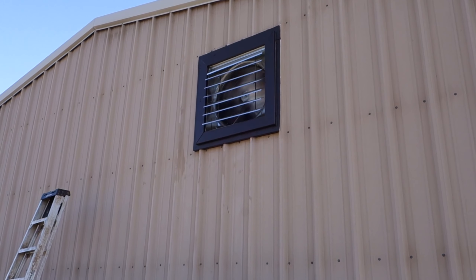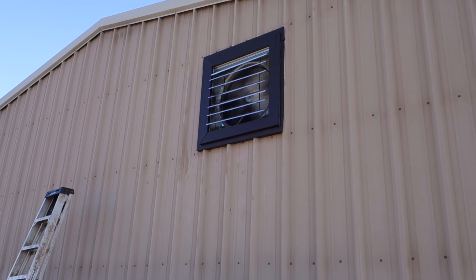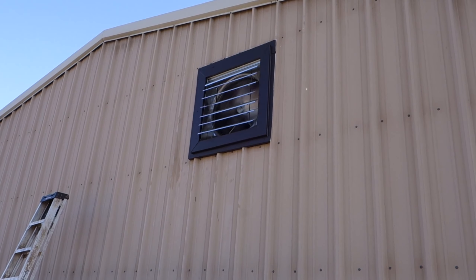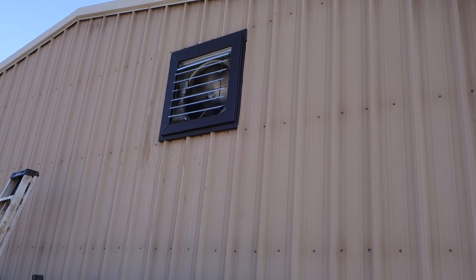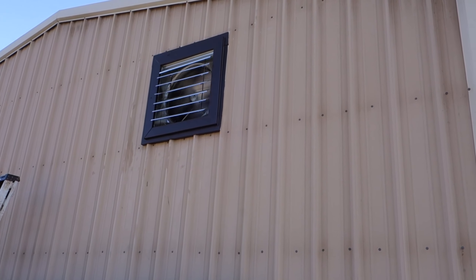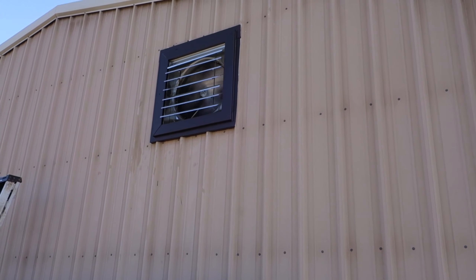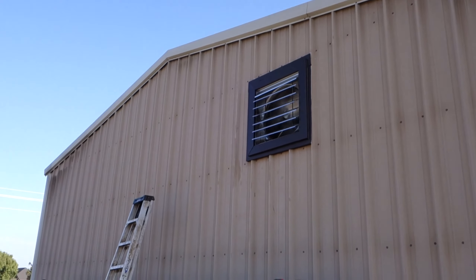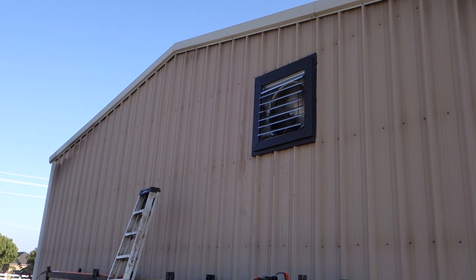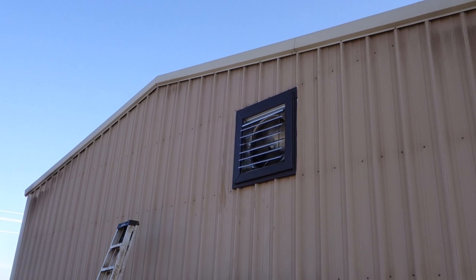One thing you want to check — be sure your shutters are still good. Be sure to take off any paint or especially sealant that dripped on your shutters. You want them to be as light as possible — if they're heavy you'll reduce the efficiency of your exhaust fan because it takes a little bit more power to open up that particular shutter. Be sure to keep them light and be sure there's nothing scraping or touching the edges. These Haslet product form-fitting frames work real well and it's a good-looking finish and very structurally sound. Here's the final product running — this is a Maxair 24-inch fan that I just installed in my steel building. It seemed to be a little bit loud but with this Texas heat it's going to be nice to have this fan, and I'm going to put another one in so I'll have two of these.